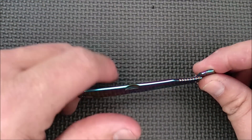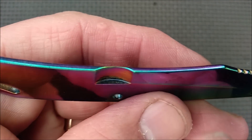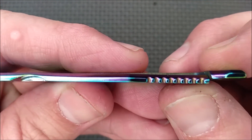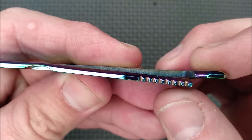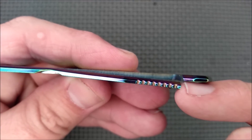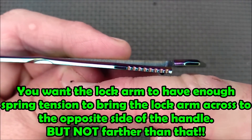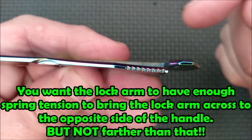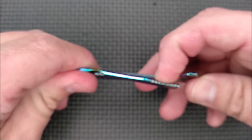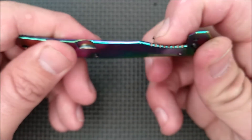What I do is I boil some water and put it in boiling water just to bring it up to 100 degrees Celsius or close to it. You don't want to heat it up too much — it really depends on what you can handle to work with. I wear the thinnest gloves I can that give me some protection against heat but still give me a sense of feeling. What I do is heat it up and try to hold it right behind this point here — that's where the relief cut is for the frame lock, so that it can turn into a spring. If this arm just comes up to about here when it's at rest and it's not pushing very far, you want a space between the liner and the lock arm right there. You want it to be able to go over so that it's pushing all the way to the other liner. If it doesn't push as far as the other liner, it's not going to be putting enough force on to hold the lock. So once it's hot, you try to hold it whichever way you can and push on the frame lock.